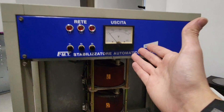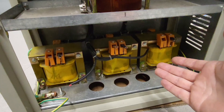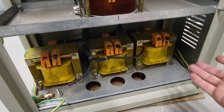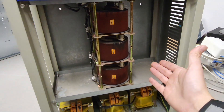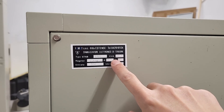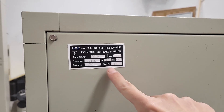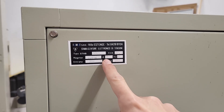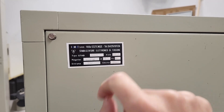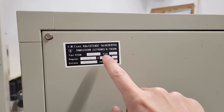This is a voltage stabilizer — it has a voltage meter that shows the output, but the real stars are the three variacs. They are somehow connected to a single-phase transformer below. The label on the back says 22 kVA, input and output voltage of 380 volts, three-phase, 33 amps at 50 Hz — and a regulation range of plus or minus 15 percent.